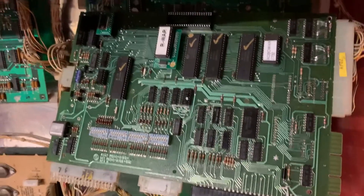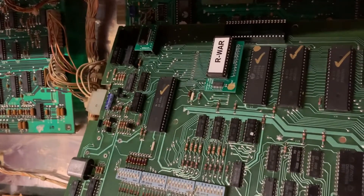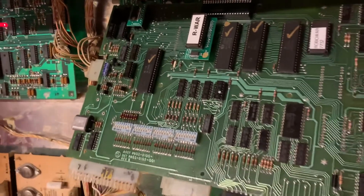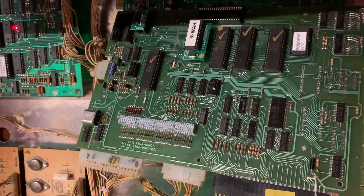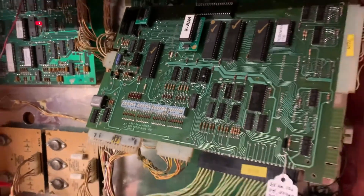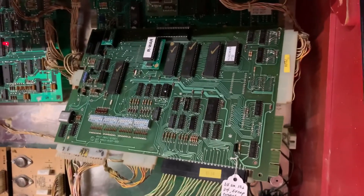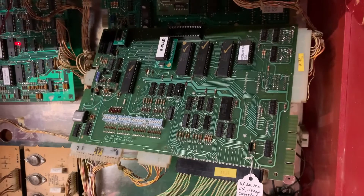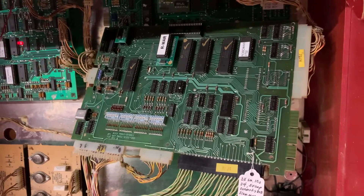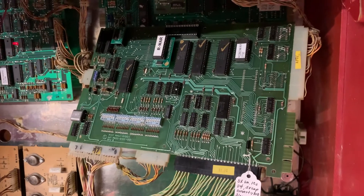1DCA is the checksum for the PROM one position of RoboWars, so this MPU is good to go. I've installed NVRAM and I'll ask the client if they want NVRAM on all four of the MPUs — I know I have a super cap on one of them. Thank you so much, and thank you for sending the Swedish paper money along so I can add that to my collection.